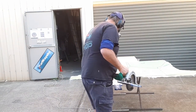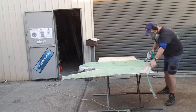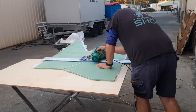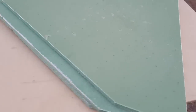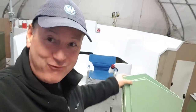Shelves don't really need to be that heavy — they are fully tabbed and glassed in place as well, like I do with everything — and that way I can keep the weight down in areas where I don't need to spend that weight. I've just laminated up a sheet of 12mm foam that I had laying around and was able to get three shelves for the port wardrobe in the stern cabin. They've got one layer of 265 woven roving on each side and peel ply. They're smooth enough for a cupboard, they're going to get sanded back anyway. I'm just going to cut them now with the skill saw and my track saw — that'll be another job out of the way.